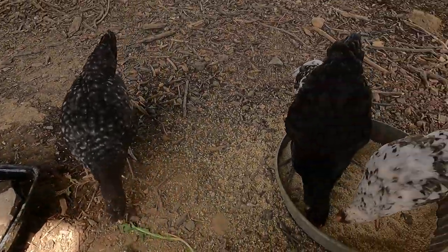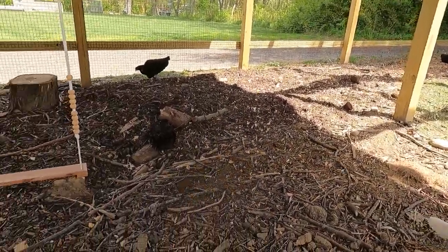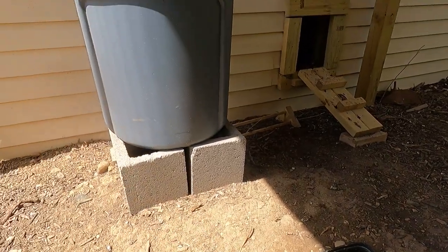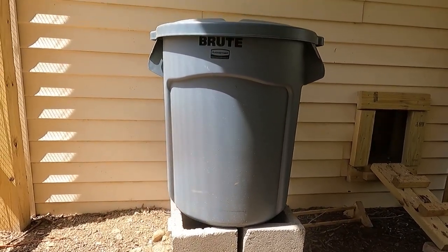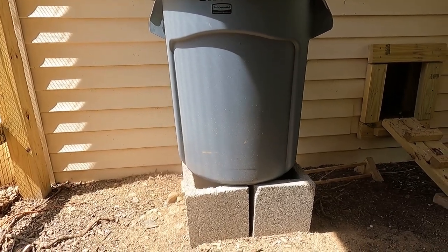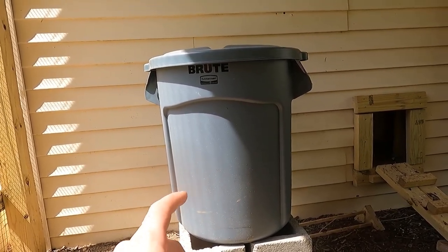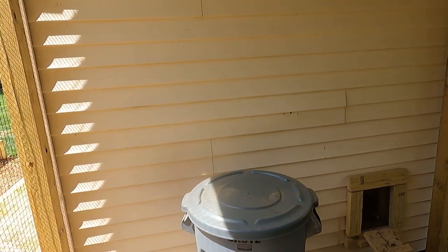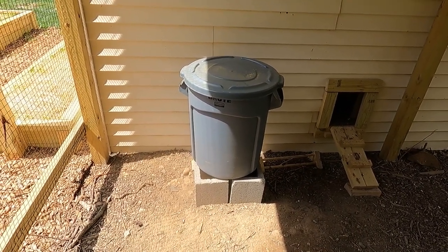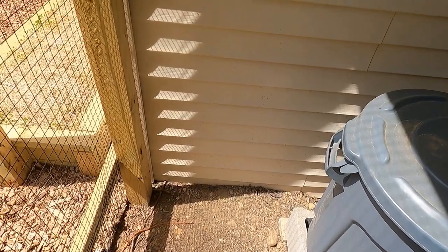The water, as you can see, gets really dirty and it's not ideal for healthy chickens. It works for now while the chickens are babies and they're learning their new territory, but we want them drinking fresh water especially as the weather warms up. This water is unacceptable. That's where this garbage can comes in. We're going to be adding poultry nipples to the bottom of it to keep the water crystal clear inside the tank. There's no light penetration so algae can't grow. We have to figure out how to plumb this in so I don't have to fill it up with a hose every couple days — that's basically what the bulk of this video is about.